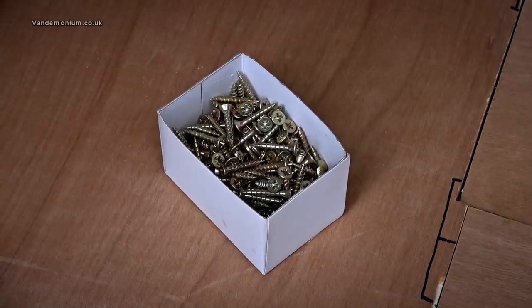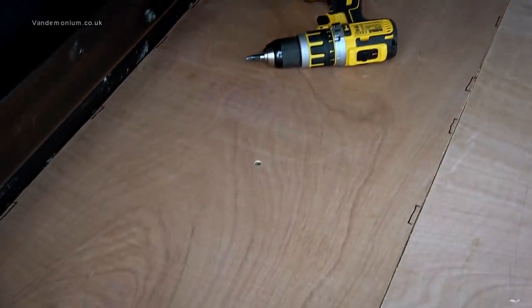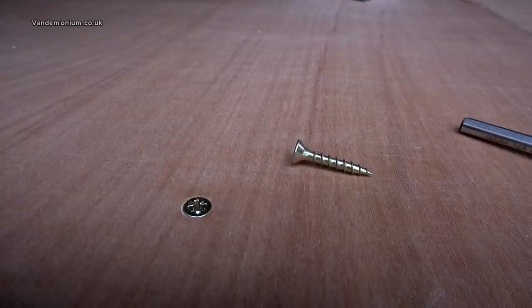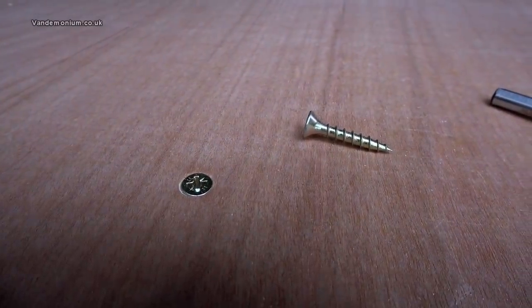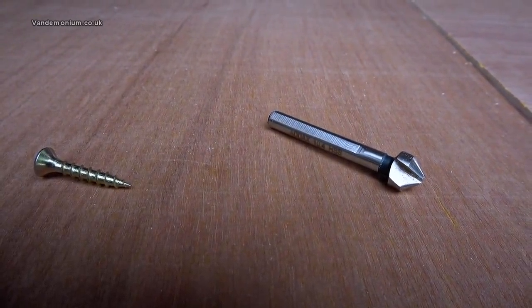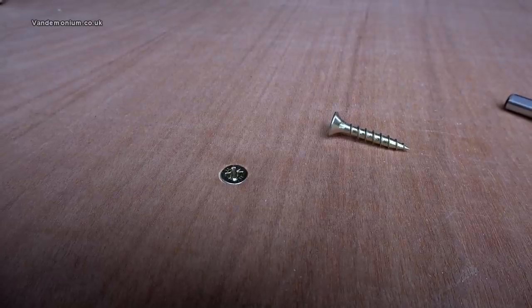It's another not terribly nice day but I've really got to get on with this van. These screws are your clues as to today's task, and if you look very closely at this board you'll see a little screw hole with a screw in it — all countersunk and nice. I'm screwing down the floorboards. I've seen a lot of people simply drill their screws hard into the wood until they lie flush, but that feels a little crude, so I've bought a countersink drill bit — drilling pilot holes, countersinking them, and then screwing the screws in. As you can see, they're flush with the woodwork and tidy.